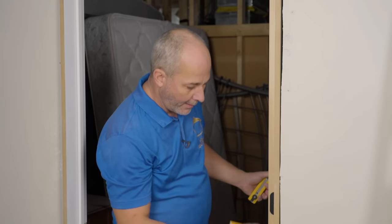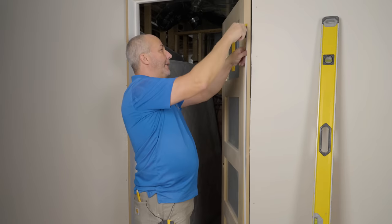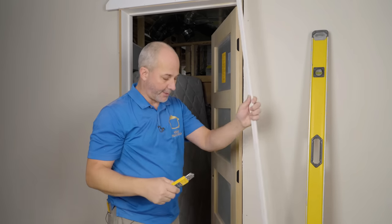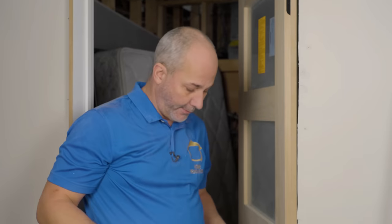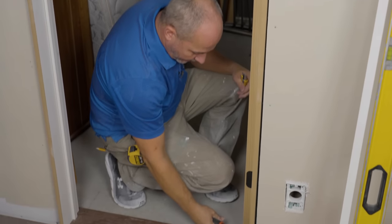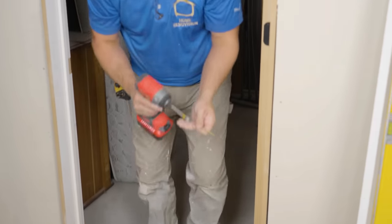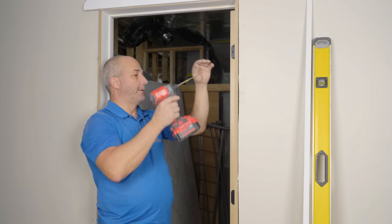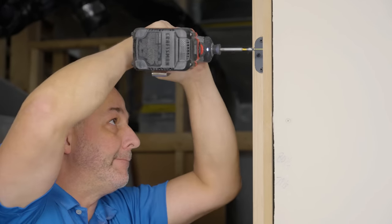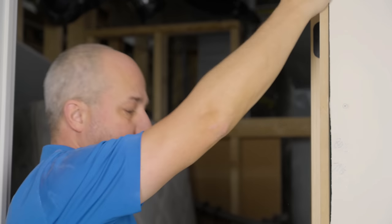I'm going to take my pencil and mark right on the doorstop. It usually comes delivered with just a couple of pin nails. What I want to do is make sure that I'm attaching this after the fact, after the install — that's why it's only on two little nails. It's not finished; it's just set there so they don't lose it during shipping. You want to take that off to install your door. Make sure you have a pair of pliers — remove those nails by rolling it against the material, preferably right where the piece of wood is going to go back, so if you make any damage or dents you don't have to fill them. Now we want to use construction screws here, starting up here between the hinge and that pencil mark.